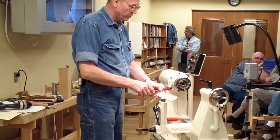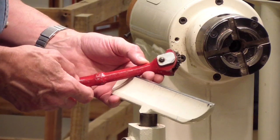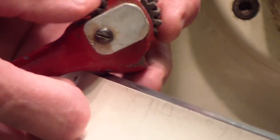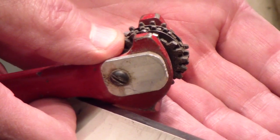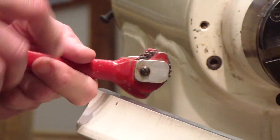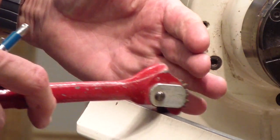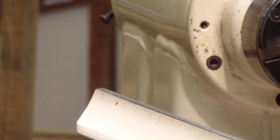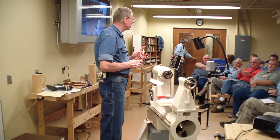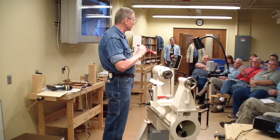I saw this in our box here. If you're going to get one of these, make sure you don't get one like this. There are some flats right on the front of the teeth here. The reason they're there is because the feet are so short — the teeth are hitting all the tool rests when they put it up there progressively. The next part is that the feet are stuck on the tool rest. This is supposed to be ground 90 degrees right here, and it hangs on the front of the tool rest and sits like this. You slide it back and forth across there. How many manufacturers do you know that go through all the trouble to build a jig and bring something perfectly square across there just to get it right? They're not going to do it, folks. The reason is it sits on the front and rests on the feet.